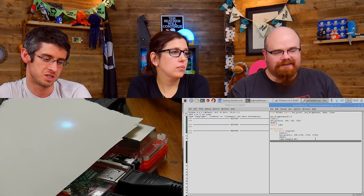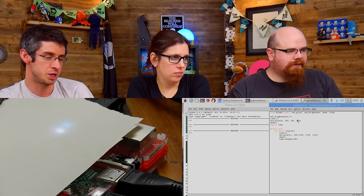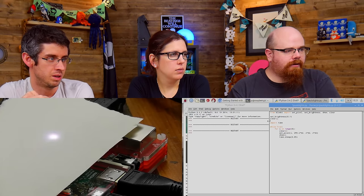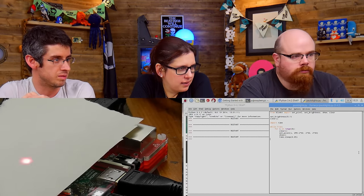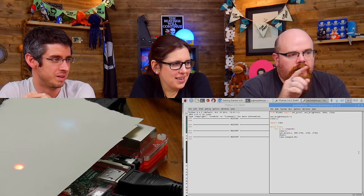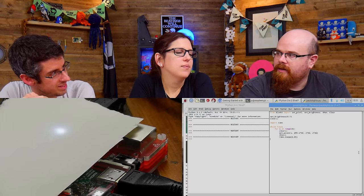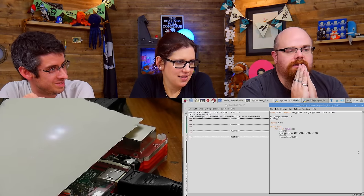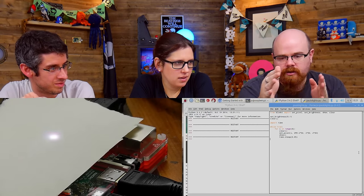So what Paul's done here is it's the same thing that was running before, but it's scanning across all of the pixels, and he's changing the RGB value as it goes across. Okay. I don't even need the stuff at the top, apart from the set brightness and maybe the clear. That is dead code. The code is so dead to me. Cool, with your set pixel there. The first one's 255 minus i times 32. I've got i in the loop. And I worked out 255 divided by 8 was not 64 and not 16, therefore it was 32. If I wanted to jump through all the values, I could do i times 32, and it would never be more than 255. So it would go through colours like that.